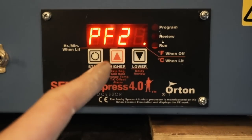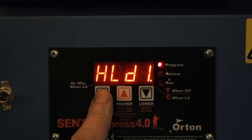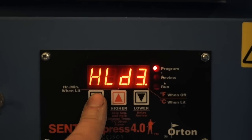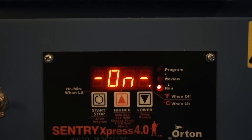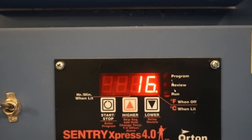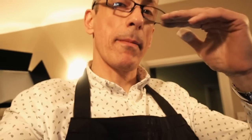We've already got the settings pre-programmed. It's 15 degrees in the kiln at the moment. It ramps up, holds, ramps up again, holds, ramps up again and so forth — set for the fourth hold, ramps up a fifth time, ready to start, and it'll click. There we go — it's going to start to ramp up in heat. It reaches about 100–150 degrees, holds for an hour, then the wax starts to dribble out onto the tray. It'll ramp up higher, burn every single residue of that wax, get all the carbon out.